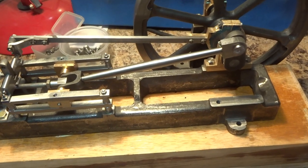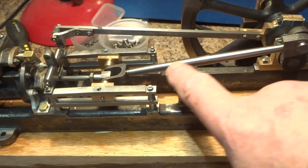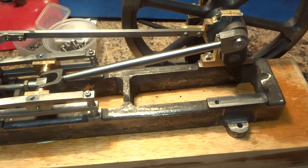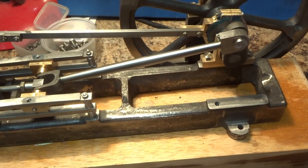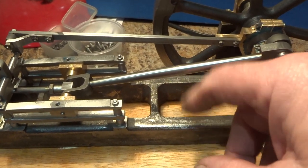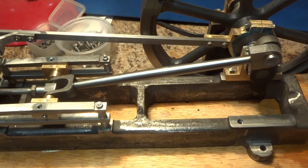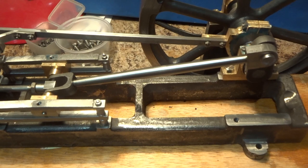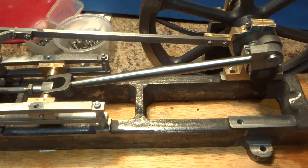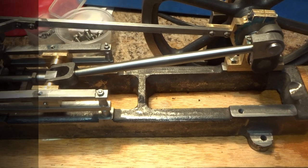So here is the connecting rod remade, third attempt, with the fish belly shape that the drawing calls for. Approximately 1/4 inch at the ends and 5/16 in the middle. Considering all the aggravation, I'm far from convinced it was worthwhile, but it's what the drawing called for, and it's what the prototype looked like, so it's done.